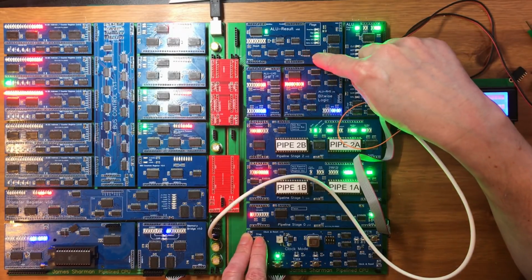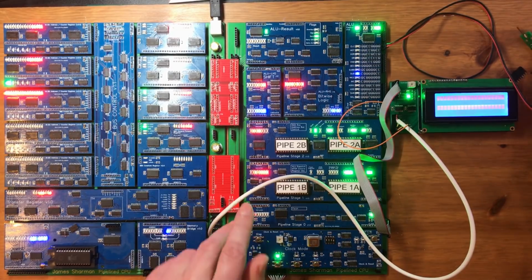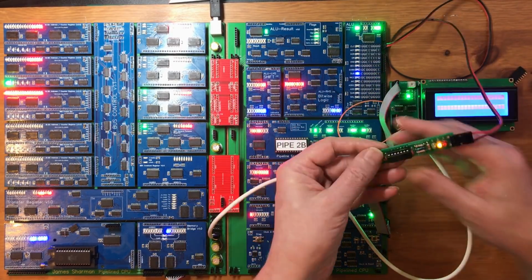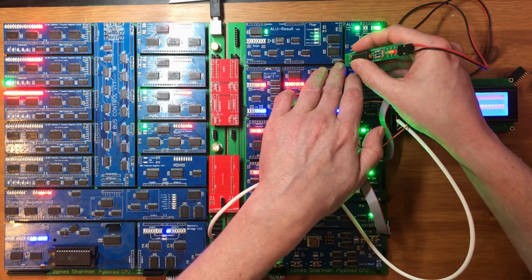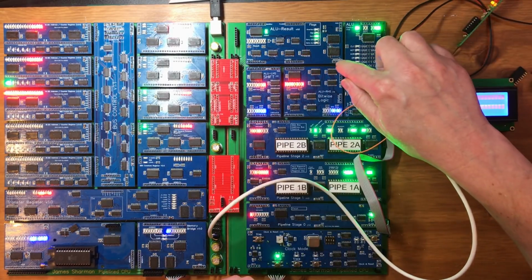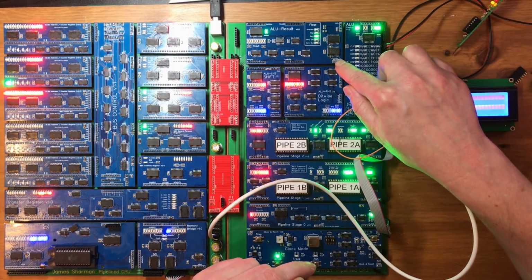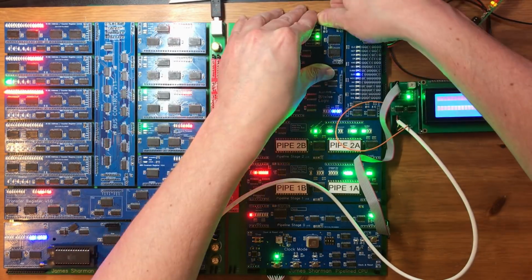Okay, now could have wired this 153 wrong. Oh, I know what this is. So this is the least significant bit here, currently 0, but I bet you, yeah, that pin is floating. So that's the wire I thought I scratched, but I've actually broken the connection. Let's hope that's all it is.